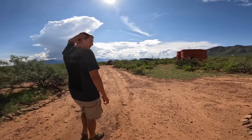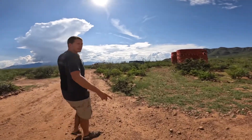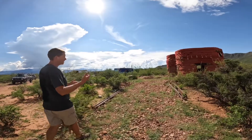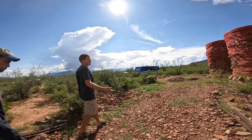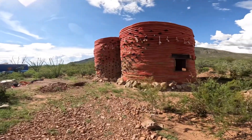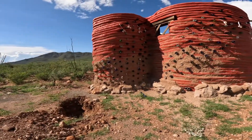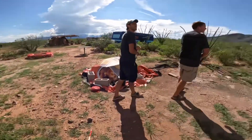It's a 15-foot interior diameter with a loft, so once it's done it'll be about 280 square feet — actually bigger than my house. We've got 18-inch bags most of the way up, then switched to 16-inch bags at the very top. This was a test house — I wanted to screw up on a small scale instead of a large scale. The earthwork took about three months. I'll never do the bottles this way again; they're already starting to fall out, so I have to figure out how to fix that, but it's been a good learning opportunity.